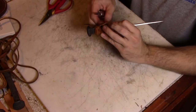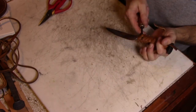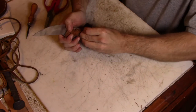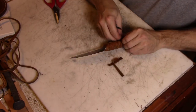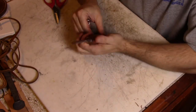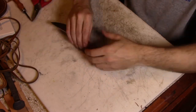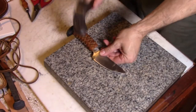The final step after you've got it all tied up is to go through and smooth the lace down, even it out by dressing up the knot — pulling the lace here and there to settle it in and tighten it up in places where it's too loose, or loosen it a bit to move things around to make everything a little prettier and neater. Then you can either roll it or, in this case since it's an odd shape on this handle, I went ahead and just pounded it to set the lace and make it smoother in the end.